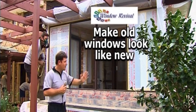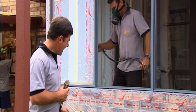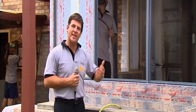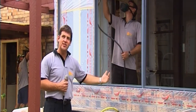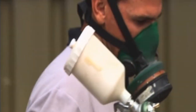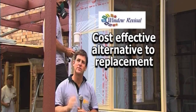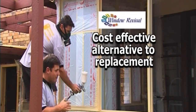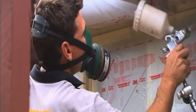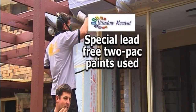Work right hand over left hand — same principle as doing the sashes. Just a nice dust coat across, then thicker to build up your film. Jamie had already pre-primed the inside, so we're just going in now. Notice he didn't take the hose in — the smart thing to do is set up a second hose on the inside, because you don't want to be dragging hoses over the top of windows and pulling off paint. One hose on the inside, one on the outside. As I mentioned on the fixed sashes, it's all about angle spraying — getting down there, making sure you're getting into all the little nooks and crannies. Notice how Jamie comes down on his angle as he goes along the fix. You've got to really get in there on the top and bottom rails, down on the angle and right up underneath it.